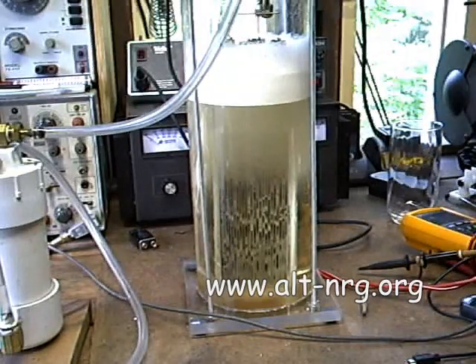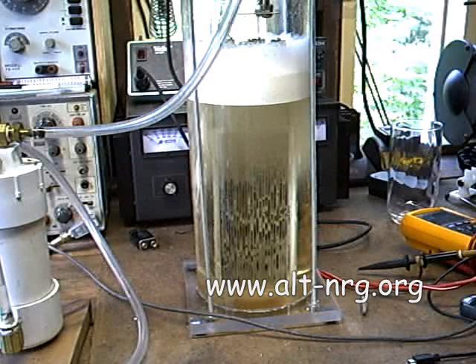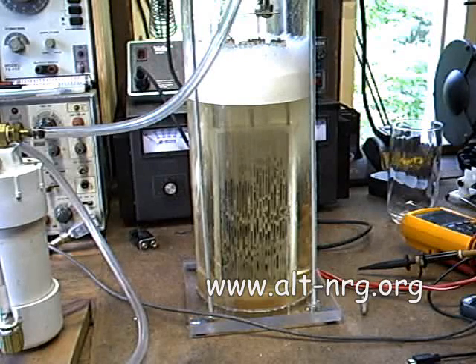I also want to mention that I've unwrapped the 14-gauge insulated wire from around the cell — I wanted to put this back into service right away. I'm going to be conducting those same experiments on the smaller five-plate stack with smaller-gauge magnetic wire on an experimental basis, rather than trying to adapt it to a production cell which I want to have in the vehicle producing gas.